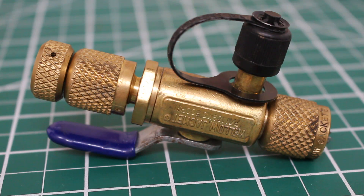What truly makes this a must-have tool in your tool bag is that you can remove and replace Schrader valves without losing the charge. The system can be fully charged and, as we know, the most common leak is going to be at that valve core, also known as your Schrader valve. The fact that you can use this tool and not have to recover refrigerant and go through all those processes to replace it is amazing. This is definitely a must-have tool in your bag.